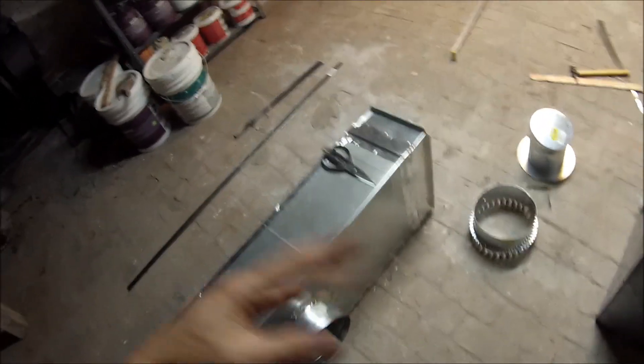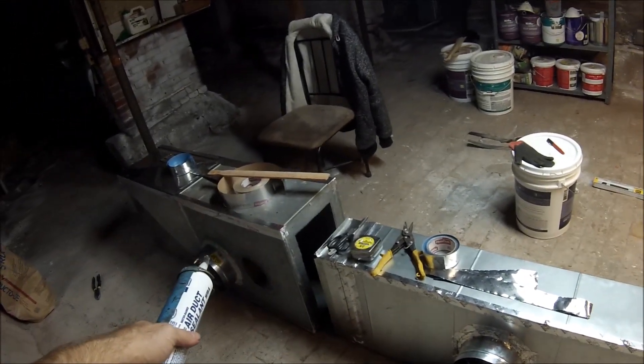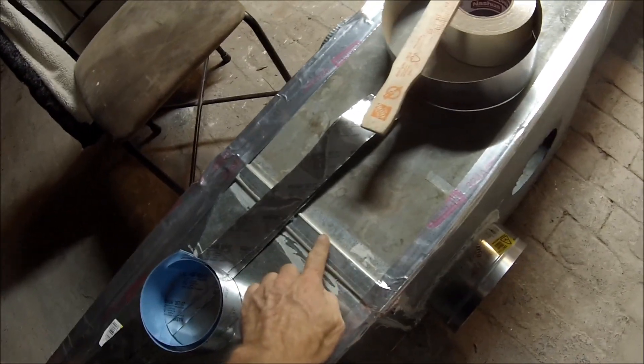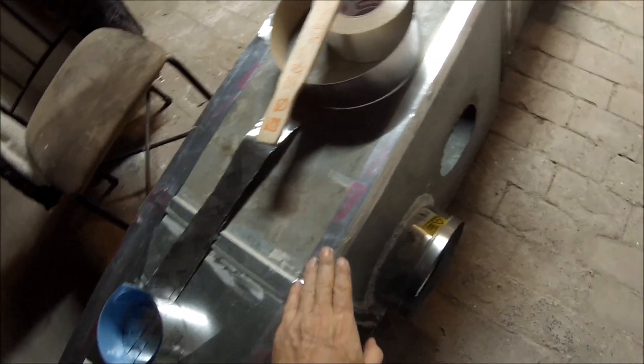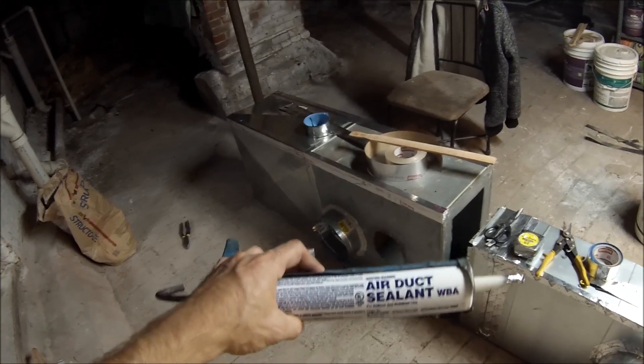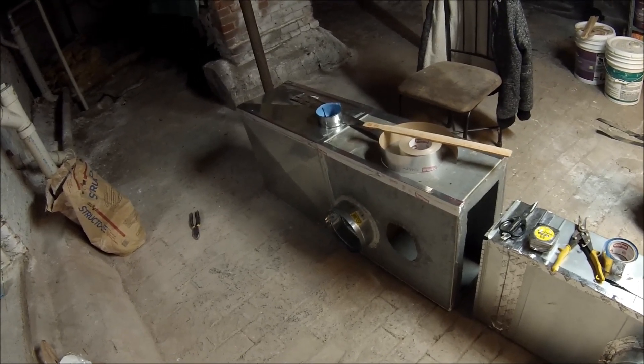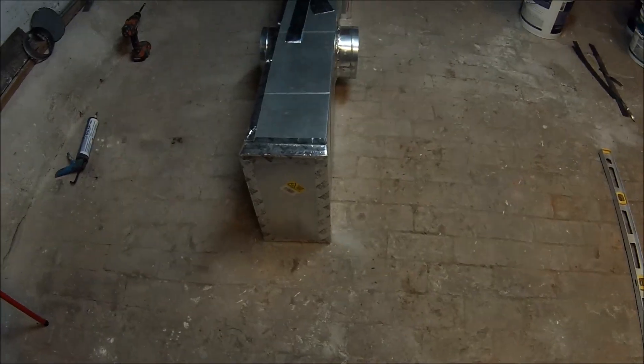You can see how I mastic-taped all this up so it can't leak any air — that's what you want to do. I'll put some duct wrap insulation over that and show you a video when it's all put together. I used air duct sealant on all the joints, waited a couple hours for it to dry, and then started putting foil tape over that. You don't have to use both sealant and tape, but I'm being extra cautious — I don't want any air leaks in my attic since it's an unfinished space.